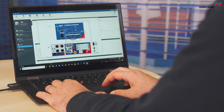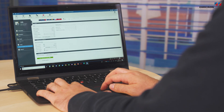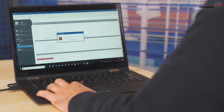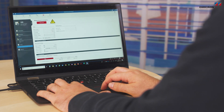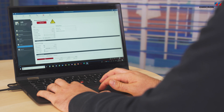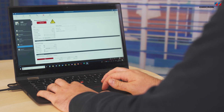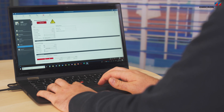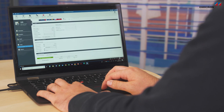After setting up the calibration according to the calibration setup, we can start measuring the calibration factor. The test is ready for execution and I can press the I/O button on the CPC-100. A defined current of approximately one amp is injected to the SCU1, and a certain voltage on the coil is measured back, defining a ratio of approximately 40 millivolts per amp in this case. Once this ratio becomes stable, I press the stop button and this ratio is automatically taken as the calibration ratio for the measurement.